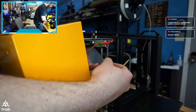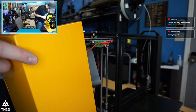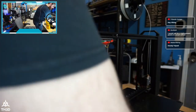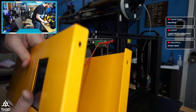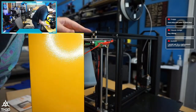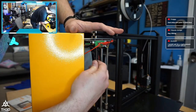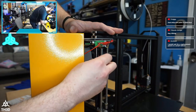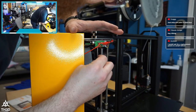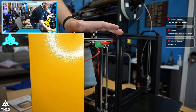There's a retaining clip on the ribbon cable. Disconnecting the main power coming in now. Do they think they tinned the wires? Let me find out. This is 18-gauge wire feeding this board. Wires are tinned — strike one. So we've got 18-gauge wire feeding the control board, but 15-gauge wire feeding the bed. It doesn't matter that you put 15-gauge here if the main wire from the power supply is 18-gauge — you're choking the bed. This is absolutely stupid.